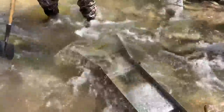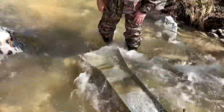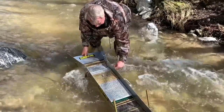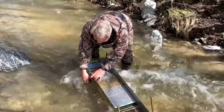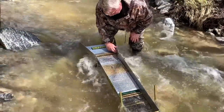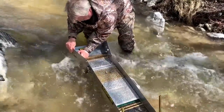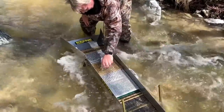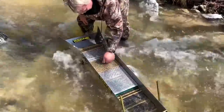All right, Pat's just going to lift the sluice up — we're going to see what it looks like underneath. Those new legs are so handy. We need to come up with a little more clever idea — it was quick and dirty but we'll get it worked out. At least we don't have that piece lifting on the front lip like we did the last test. Every time we'd lift the screen, rocks would lift that front lip and get underneath it. It's not going to happen this time. That's part of testing — you live and learn.